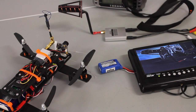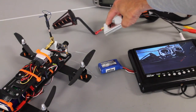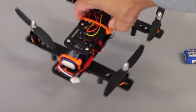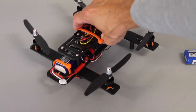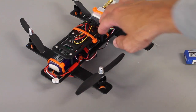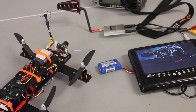Not a bad first go at it. There was a little bit of static — I don't think it had anything to do with interference from the ESC. While I was flying, the helical antenna fell down, which is definitely not the best orientation for good reception. I also noticed the gains are really a little bit low for this quad — it was pretty sluggish in the air. I want to work on dialing those in and maybe even putting the CC3D board in there instead of the Multiwiicopter. Dimensions are the same, so I could just slap it in, tune it, and give it a try. But all in all, I'm pleased with the first results.